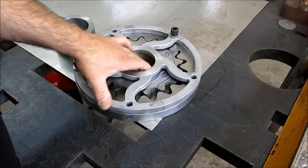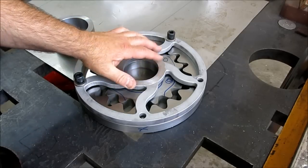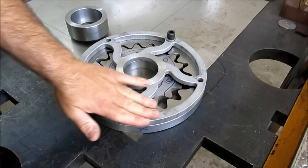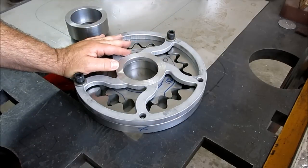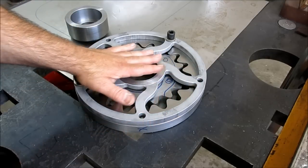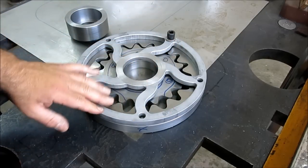So we've got the wobble partially assembled here. I went back and faced a few thousandths off of this to make this mounting surface parallel with the face that mounts against that. In retrospect, Colin Chip mentioned - why not just face the whole side? I probably should have done that, but I really didn't want to lose thickness. I should have gotten three-quarter thick instead of five-eighths, then I could have just faced both sides.